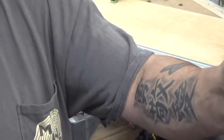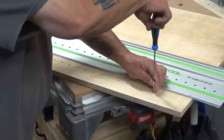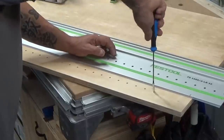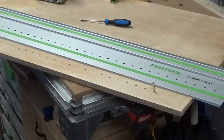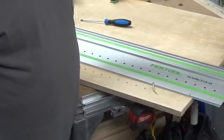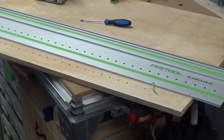So it's got the notch that accepts the Allen key. And then you would put this in here, take the supplied screw, and thread that puppy right into it. And of course you would have whatever. I would have, say, another one here, maybe a domino, and now I have my bottoms. When I make my second one, I sandwich together, tighten it up, boom, you're done. In this case, I'm probably going to be using glue, but that's it.